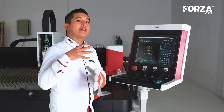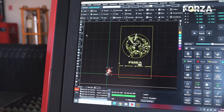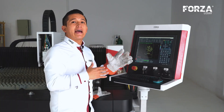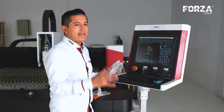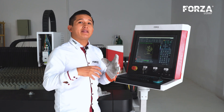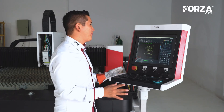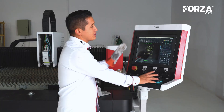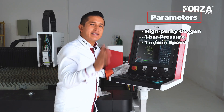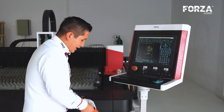The design we're going to use to make these cuts is a hummingbird, which has quite a lot of intricate details. We use it precisely to see what the limit is for small cuts that can be performed. We're going to start with 4mm and then gradually decrease the thickness. This initial piece measures 40 centimeters. The details aren't super small, because it wouldn't make sense to try to make something too tiny on a thick material — it would automatically melt due to the heat. As we decrease the thickness, the size of the piece will also decrease. This first cut will be done with high-purity oxygen at a pressure of 1 bar and a speed of 1 meter per minute. Without further ado, let's kick things off with the first sheet.